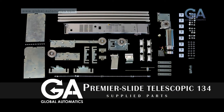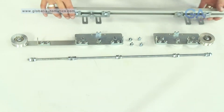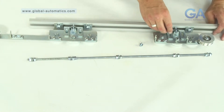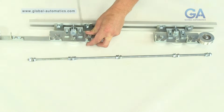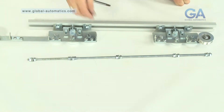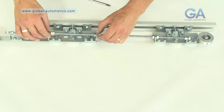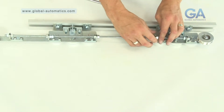Building the slave leaf. Select the long arm and the short arm carriage assembly, the studding and four 12mm Allen bolts. One, line up the back carriage assembly that was just assembled with the long and short arms as shown. Two, fix in position as shown using the Allen bolts and tighten. Three, line up the studding nuts and the washers to match the positions of the bracket on the long and short arm carriage assembly. Make sure the washers are either side of the bracket. Four, tighten the nuts as appropriate to secure the studding in place.